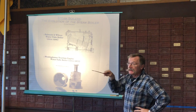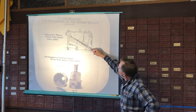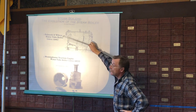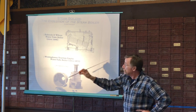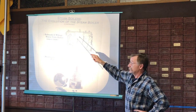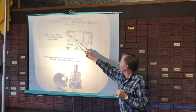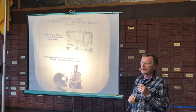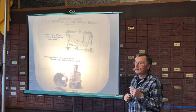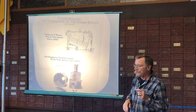This is a neat boiler and kind of a milestone — all modern utility boilers evolved from this point forward. We have one example on site of a water tube boiler: it is the Westinghouse style boiler, original design from the late 1800s. Our example is from 1906. It is very similar to the Barlow boiler in that it has horizontal tubes. It has an outer shell that goes up over the structure, held on by bolts around a ceiling ring. There are a total of five or six horizontal arrays of tubes — some going one way, some another — constituting the majority of the heat transfer area.